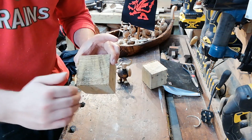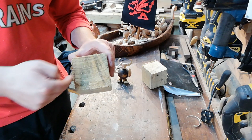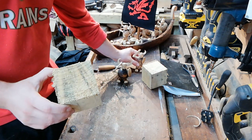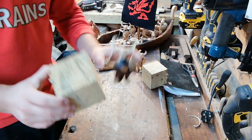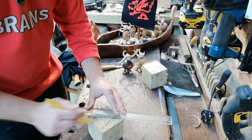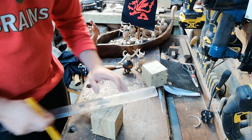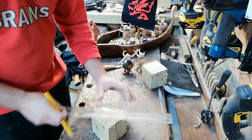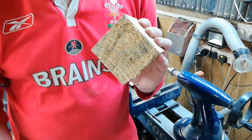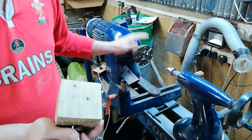What we're going to do is mark a cross on the end grain. If you want smaller body sizes you can cut these down into smaller squares, which will give you something more like these figures. But if you want a chubby Viking you can start off with a thicker block. We're going to draw a cross corner to corner — that gives us our center point so we can accurately line up our tailstock and live center. We'll line these up on the lathe, put our spur or drive center into the center of that cross, drive it in, and put it into our headstock.